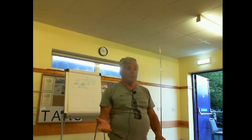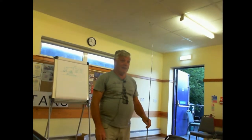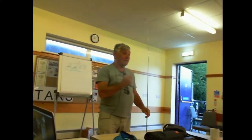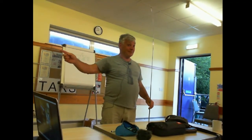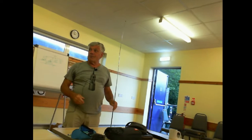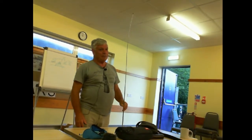The reason why we measure it to the 2 to 1 point, if people are unaware of this, is that the actual loss due to the VSWR at 2 to 1 is 0.1 of a dB. Got that? That's all you've lost, 0.1 of a dB to the 2 to 1 point. Go to the 3 to 1 point and you lose half a dB. It's not until you get to the 6 to 1 that you start to lose 3 dBs. So anybody that says, oh, it's so much better, I've got the VSWR down from 1.5 down to 1.2 and I'm getting more and more dBs out of it, is absolute rubbish. You're not.